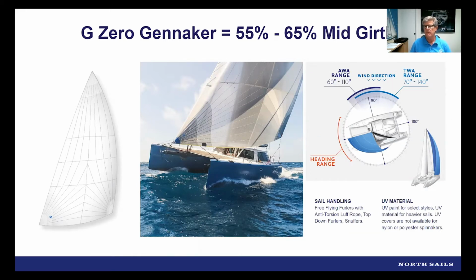Yeah. And one of the things that we do to make sure that even if the drum does spin, I don't know if you can see in the picture, Phil alluded to it, there's this big rectangle of Velcro here that seals the sail shut. That really helps protect against the thing becoming unrolled accidentally, and makes a really cool sound when you actually trim the sheet in, because the whole thing peels off like a giant Band-Aid.